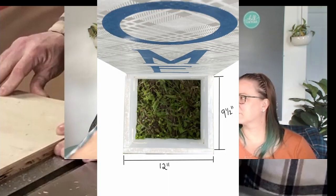So the board is 12 inches wide, the front board is 12 inches wide by nine inches tall, and the side boards are nine and a half inches deep so it gives you a little bit of room to get the pot in and out, by nine inches tall. We'll put together a Google doc with all the dimensions and a quick overview with all these instructions so you guys can download and print it out. It's a lot easier to understand when you have a dimensions diagram right in front of you, and you can take that sheet of paper right to Lowe's or Home Depot.